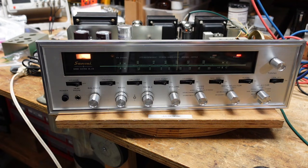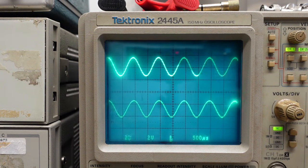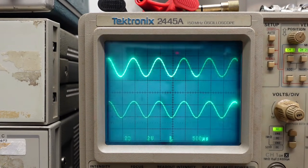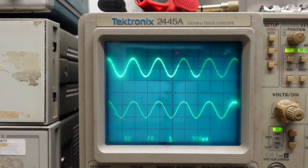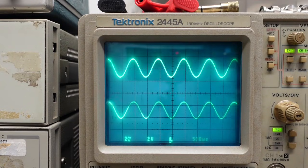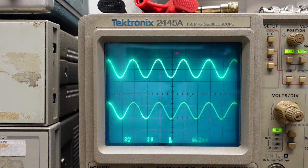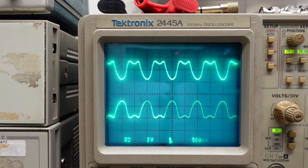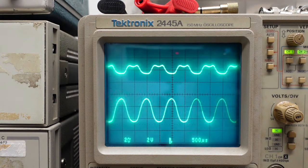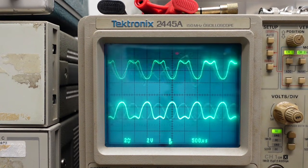Hopefully you got the idea — there's a lot of distortion. I'm going to feed the signal generator in. In mono it looks great, but when we go to stereo the problem exhibits itself. The signal generator output from the receiver currently in mono shows a little interference — that's just the 19 kilohertz sub-carrier pilot signal. Turn it off and it cleans up the sine wave and looks good. The problem comes when we switch to any mode other than mono — left equals minus right, or right equals minus left — we have a serious problem. Left only, right only, we have issues. There's a clear problem in the multiplexer.